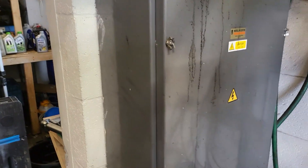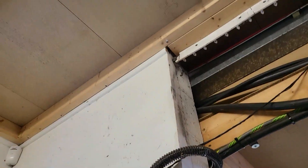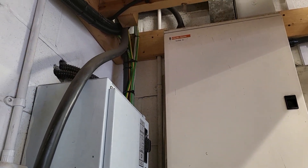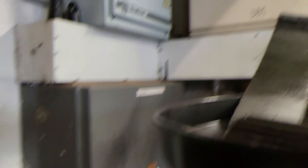This is the main intake downstairs. You've got the main isolating switch which comes off the incoming service supply. It splits across to an MCCB panel board at the other side of this room and then comes back to that three-phase board. It's a bit of a mess — it's all exposed out in the workshop and we're not happy with it like that. So we're going to put an MCCB panel board near the main switch on this side of the wall, and then obviously we can take our trunking and containment up to that new board. All of the existing steel wire armours for the other sub-boards are going to be long enough to make connection into that. It'll all tidy up quite nicely and give everything a bit better protection. It is a bit of a higgledy-piggledy one because it's going to be on somebody else's channel as well.